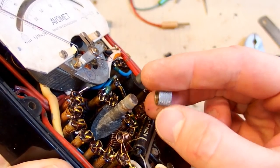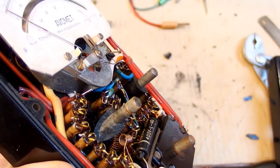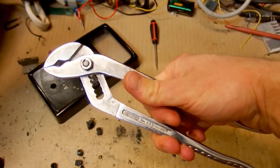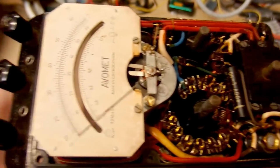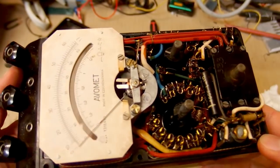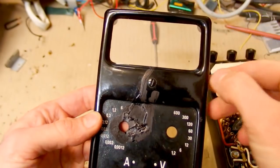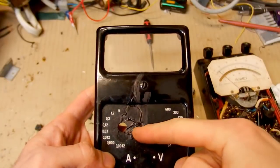After a lot of struggle the metal ring is removed, and the current range switch does move a little bit with quite a lot of force — it's full of glue. Let's set it to the highest range, 6 amps, and after reassembly we can test it. I also glued the cover crudely together and put some new glass in it for protection — basically fixing damage done by glue using another glue.